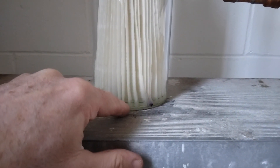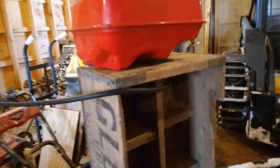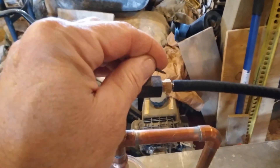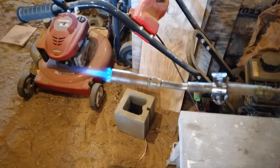I looked at the example of an evaporative cooler or swamp cooler — water is dripped down on an evaporative pad and gravity soaks it all the way through, so you get full use of all the surface area. To get a good steady continuous flame on the torch, I found that having a continuous supply of gas coming in worked best. So I added a drip feed, and I added it so the gas would drip and soak down a cotton rope that reached to the bottom of the jar. With this setup I was able to get a good continuous flame.